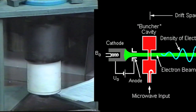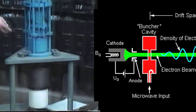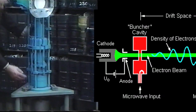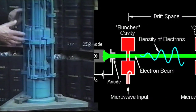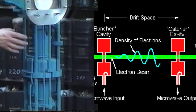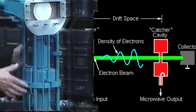That very high voltage beam — now an electrostatic beam — is put through what we call a magnetic pole piece, an iron plate. It goes down a long drift tube and stays collimated by means of a large electromagnet, which is not shown here — it's been removed — that keeps the beam from spreading.